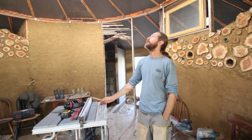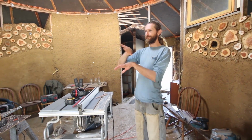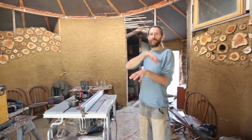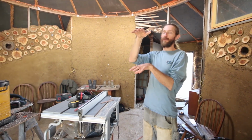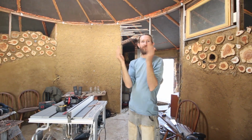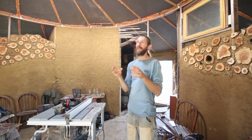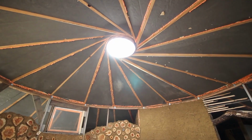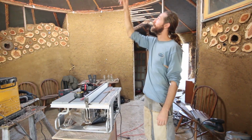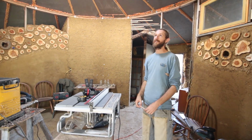And this here is a light tube, and it's a little different than a skylight in that there's two airtight domes, one on the top and one on the bottom, separated by a big air cavity, so there's some insulative value to it. And then there's aluminum flashing along the inside of that tube that reflects a lot of light, so the sun comes in the top dome, bounces off of the aluminum side, and then bounces off of all the little reflectors on the bottom side of the dome. So without any lights on in here, it's pretty bright most of the time.